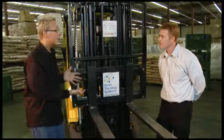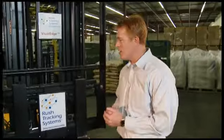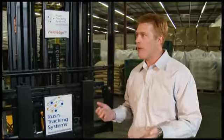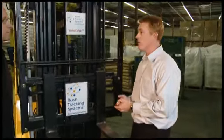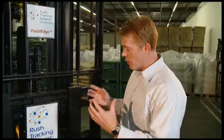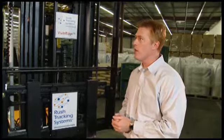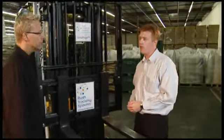A lift truck is a really tough place to put RFID technology. As you can see, there's a lot of heavy steel here, and basically everything on a lift truck gets impacted at some point. The Impinj Speedway Revolution really meets our key constraints for a lift truck reader. We think of it as three major constraints: small packaging that fits within a protective guard; high performance in terms of sensitivity and advanced filtering to avoid stray reads; and overall durability — we've taken actual measurements of 25 to 30 Gs on a lift truck fork.